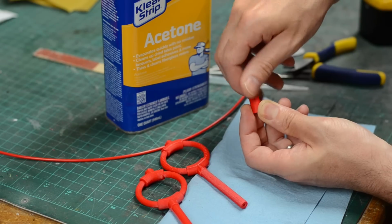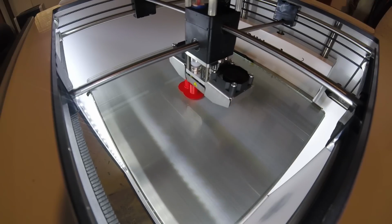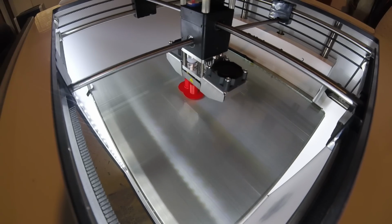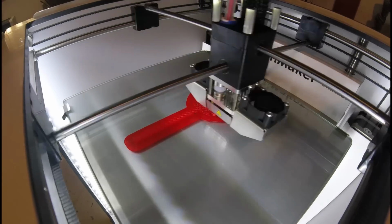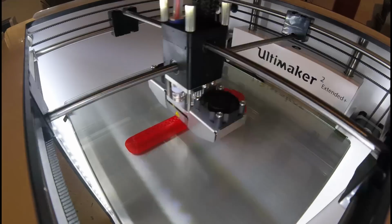cool. I then designed and modeled my antenna, printed those out on the super rad new Ultimaker that I've got, and I did the same thing with the screws, but I printed them in different orientations. This way, the screws would print in a good orientation that would make sense, and the antenna are printed the long way so that they were more structurally sound. I don't want to bump into someone and have these things snap right off.